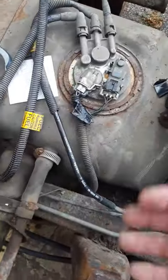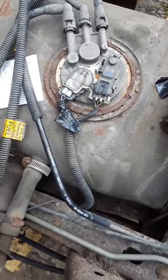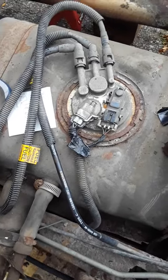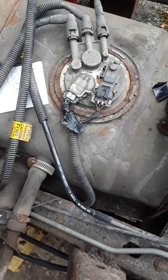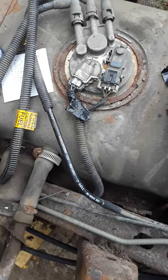I got this one here - it's a little more blunt, a little more surface area - and then I was able to confirm that the black wire coming out of here would go all the way to the ground down there. I fought with that - I couldn't understand why this black wire wasn't grounded. I got the schematics and sure enough. I waited a day and slept on it. My point is: make sure your grounds are clean, and make sure your probe can actually do the function you need it to.